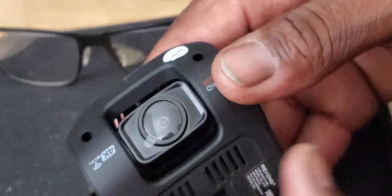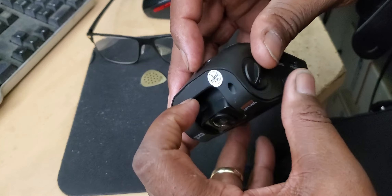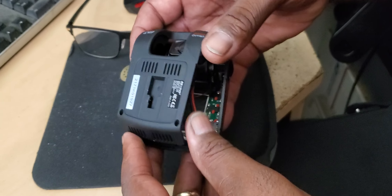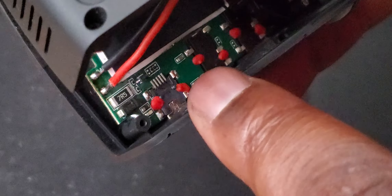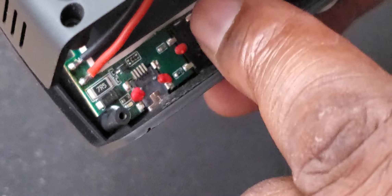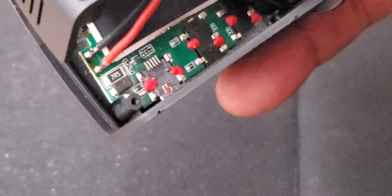I hope this helps you learn more about your Rexing dash cam. If you had the issue of the power not working and you know this should be a good dash cam and you've already swapped out your power brick, the USB connector is one thing to look at — see if it's loose or disconnected, or swap it out completely. You can also hardwire it using the negative and positive on the last pins on each side. You can test that with a voltmeter to make sure you're actually getting electricity on the other side. Thanks for watching.